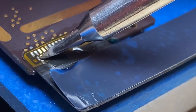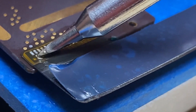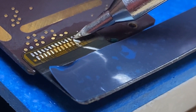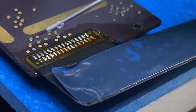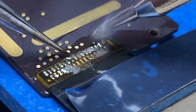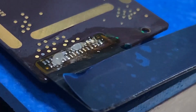That's what allows you to get a nice solid joint between a pin and a pad, or a through-hole pad on a flex cable and the corresponding pad on a logic board below. Flux becomes your best friend when soldering, and there are several different types of flux — some are thinner, some are thicker, some get tacky, some don't, some are easy to clean, some are harder to clean, some are considered no-clean flux and others aren't. Over time, as you use the different fluxes that you purchase, you will find out which one you prefer. I'll have links in the description to all of the different products that I recommend and use on a day-to-day basis.